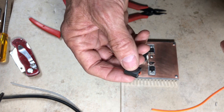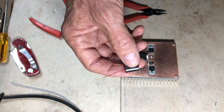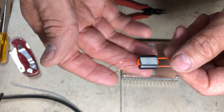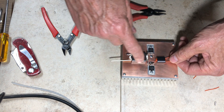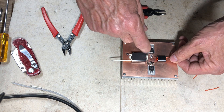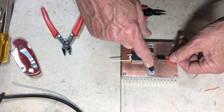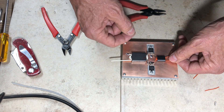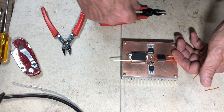I'm using plastic-covered wire for the two-turn winding just to distinguish it from the magnet wire and avoid confusion. That's what the finished input transformer looks like. It will mount right here, with capacitors to DC-isolate the gates while passing RF directly. The DC path is kept separate so we can inject gate bias without it shorting through the coil.